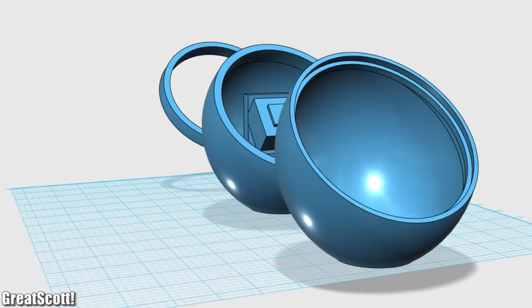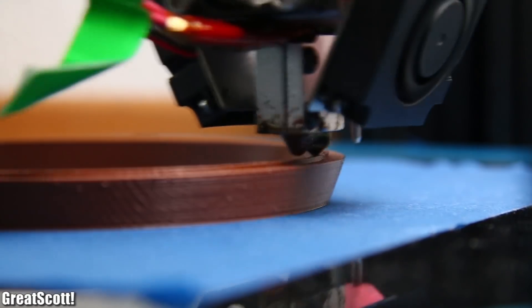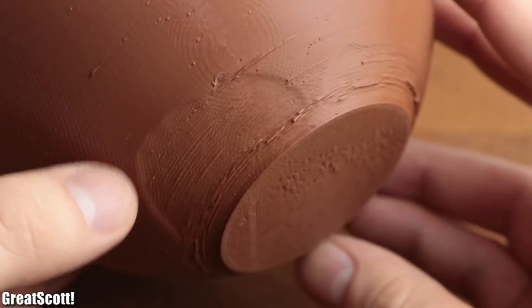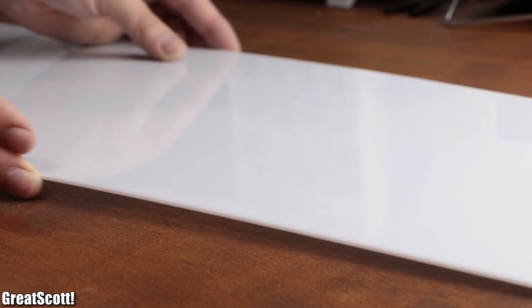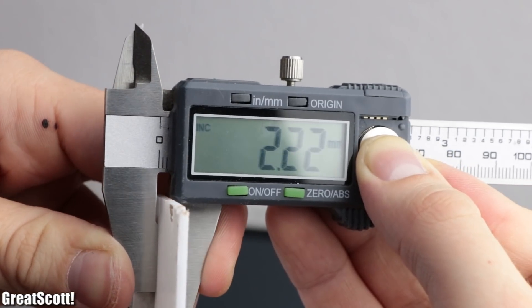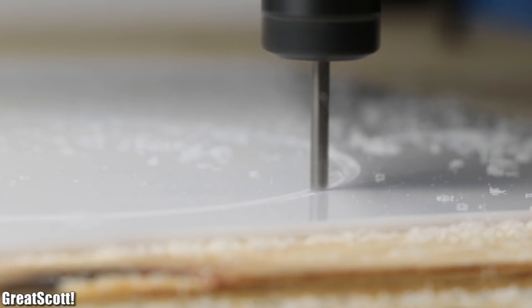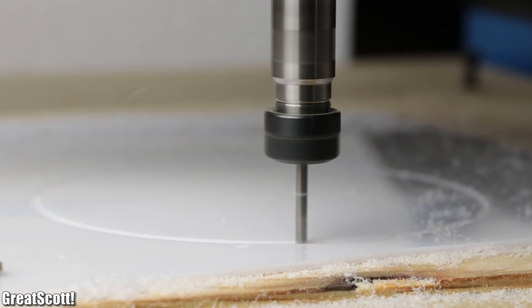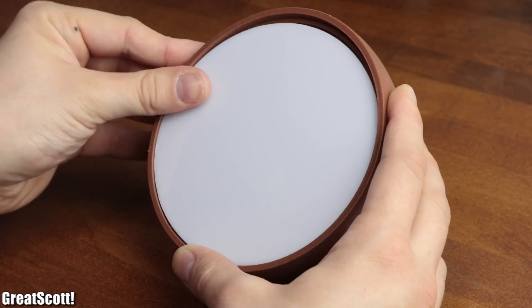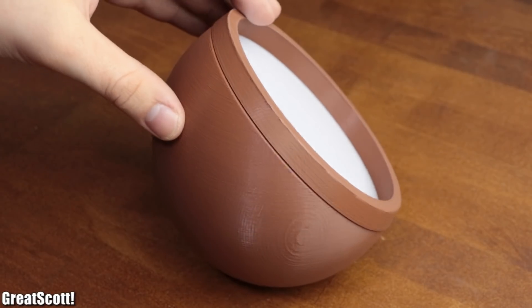Before soldering the components to a perfboard with copper dots, I designed the enclosure for the lamp with a 3D design tool and printed it with my Delta 3D printer. While the result was certainly not perfect, it was definitely good enough. So I brought in a piece of milky white acrylic glass with a thickness of around 2mm, created a smaller piece of it and secured it in my CNC machine. With it, I created a precise circle with a diameter of 12cm. You can also use a handsaw for that job, since the cap of the lamp enclosure will cover up all rough edges. And with that done, the enclosure was complete.